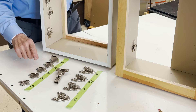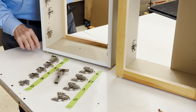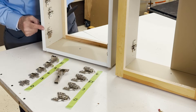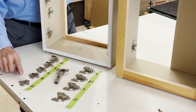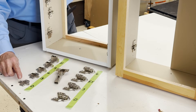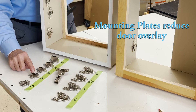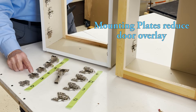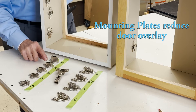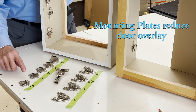These are the mounting plates used with European hinges. This hinge will actually attach to any one of these mounting plates. This is the series of mounting plates that you would use on a frameless cabinet. They come in various thicknesses. The zero plate means it will have absolutely no effect on the overlay of the door. A three millimeter thick mounting plate will reduce your overlay by three millimeters. The six millimeter plate reduces your overlay by six, then nine, and 18, and so on. That is the frameless cabinet series of hinge mounting plates.